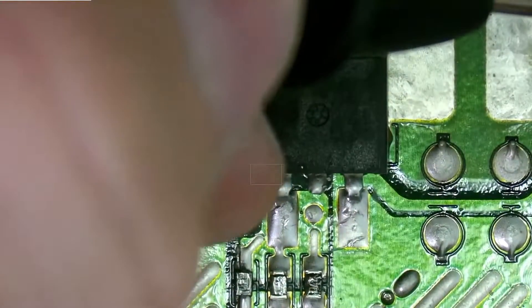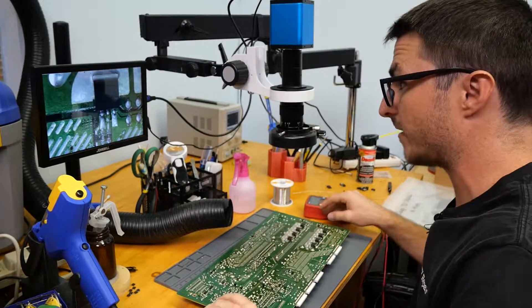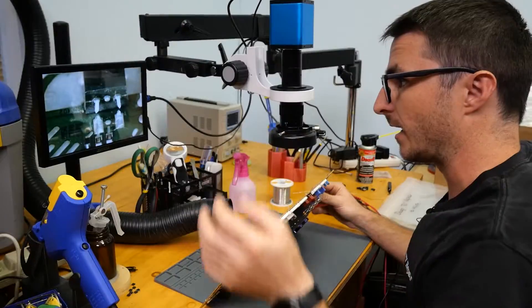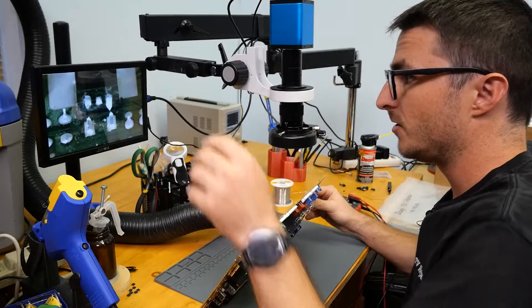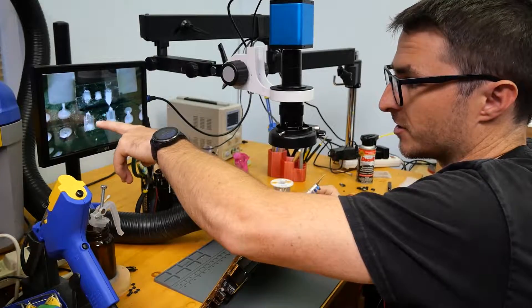The top row we don't get a beep. However, something I want to show you — and this is why we have the microscope — some of these actually got really damaged and they're no longer making contact with the board. You can see here that the legs are soldered in but somehow they just got completely burnt up.